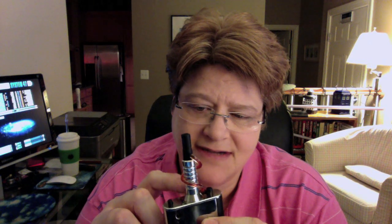Even though mine is a silly chrome box mod, the 510 connector is different than almost everyone else's, in that it almost has an adapter built in on top, so it's perfect with a drip shield. In other words, they all have that extender part that sticks up. That pretty much makes them perfect to just drop a drip shield right down onto them.